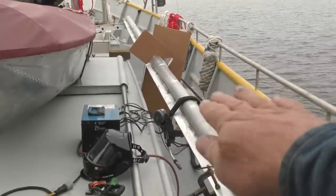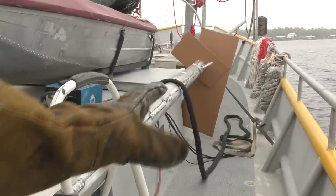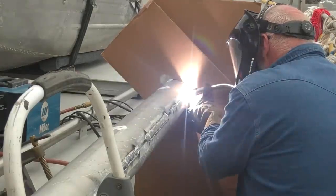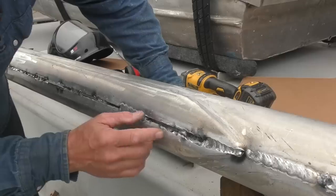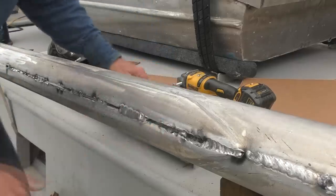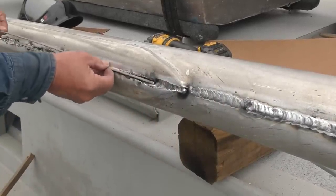This morning I've rolled it over on its side and took the bend out by putting pull-down force in the middle, braced on both ends. The only thing about working on the bows is you can always be assured the wind is going to be coming from the same direction - always. There are two passes down below and then one big cover pass. I've got plenty of weld where the plate comes up and meets the pipe, but this doubler is giving me trouble - I've got a big gap in there. I'm taking advantage of a little scrap laying around and putting pieces of it in there so I don't have to put in quite so much welding wire.